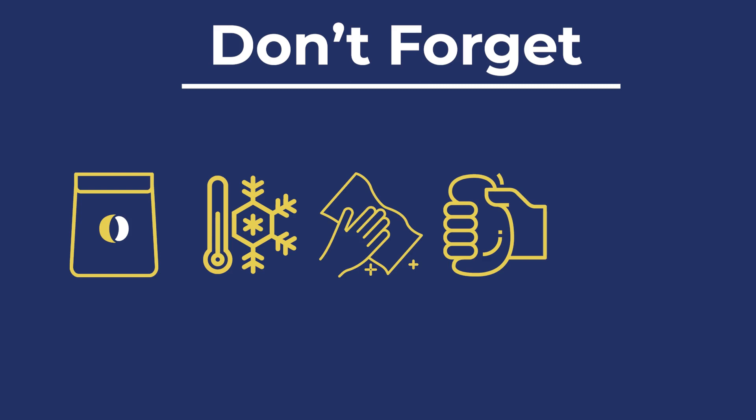Use the right amount of thoroughly mixed putty. Remember, mix the putty until it turns green and has no streaks. If you are repairing a threaded fitting, your putty rope should encircle the entire circumference of the joint without exceeding the height of the female fitting. Finally, keep the pressure sealing tape stretched to its maximum tension while wrapping directly over the putty. Do not chase the leak. Use the entire roll of tape.